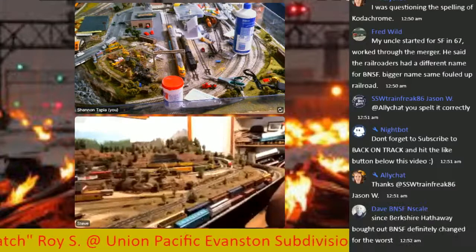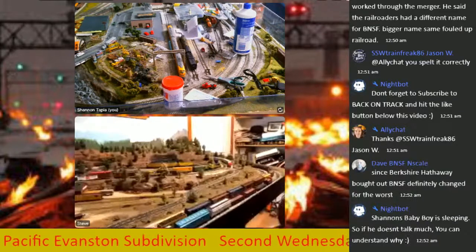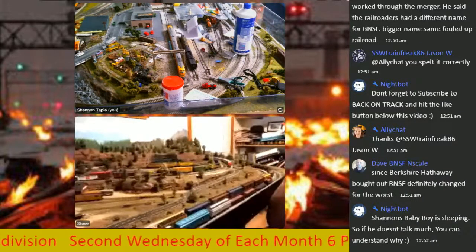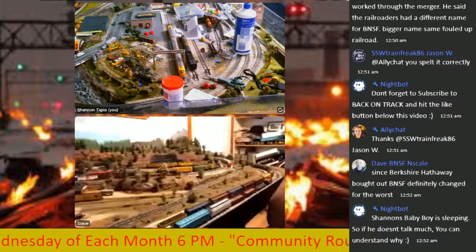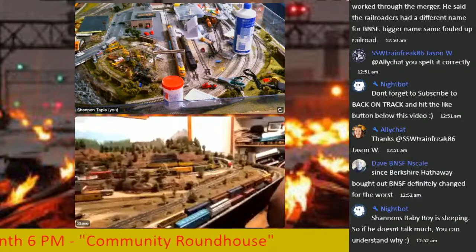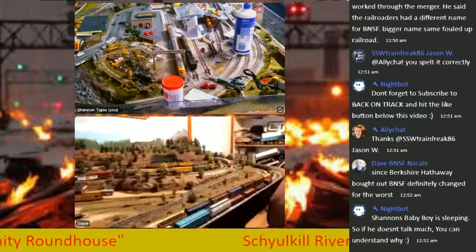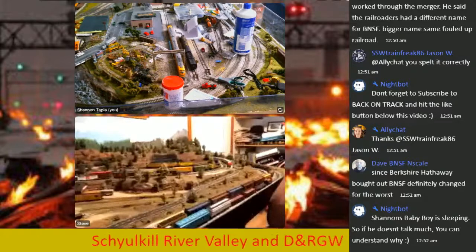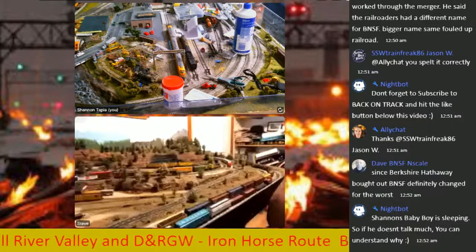The knuckle is designed to be the weak link of the whole freight string. It's designed to break. It'll break at 250,000 pounds of drawbar force. You can actually pull it past that, just the stretching of it. But if you get a little bit of slack and then you jerk that out, that knuckle's going to break. It'll just break clean in half.